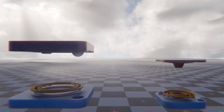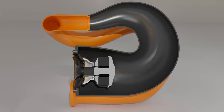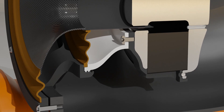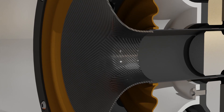Much like version 16.1, the spider and surround were created using a two-part silicone mixture that was injected into the mold with a plastic syringe. The internals of the speaker have remained unchanged from version 17. The spider and surround are exactly the same shape and size, just different materials. Same with the cone — it's now made of carbon fiber instead of nylon.